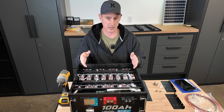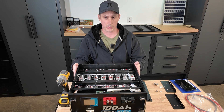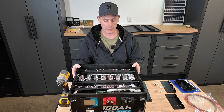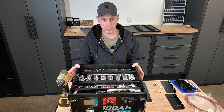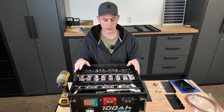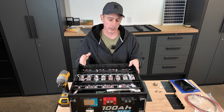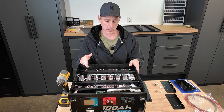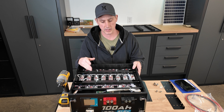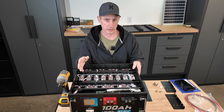This is a server rack battery meant for indoor home use — you're not going to be putting this in an RV or anything like that. It's already going to be temperature controlled indoors, so I don't see that as a big deal, but it would have been nice if it was connected directly to the cells. So let's test the cold temperature protection and see if those temperature probes will shut the battery down if there is a cold temperature event.